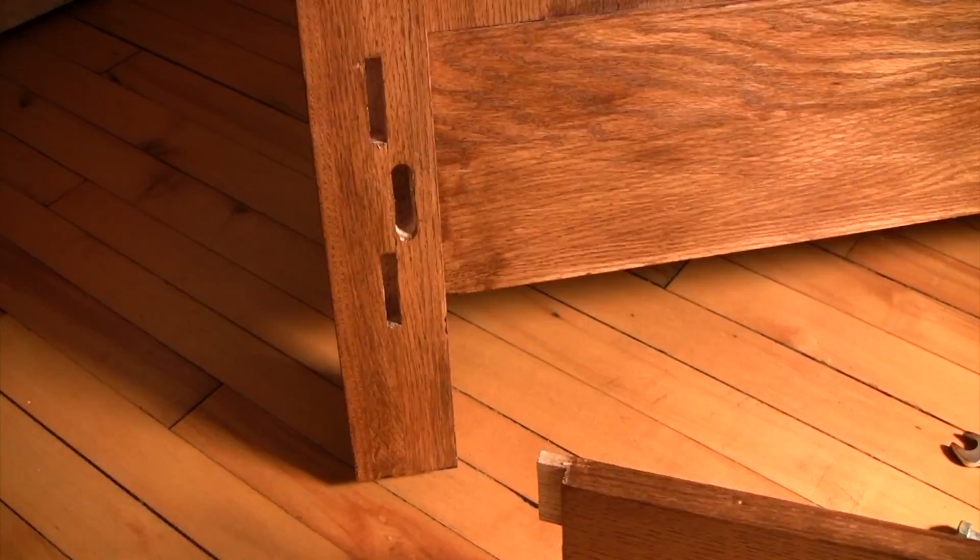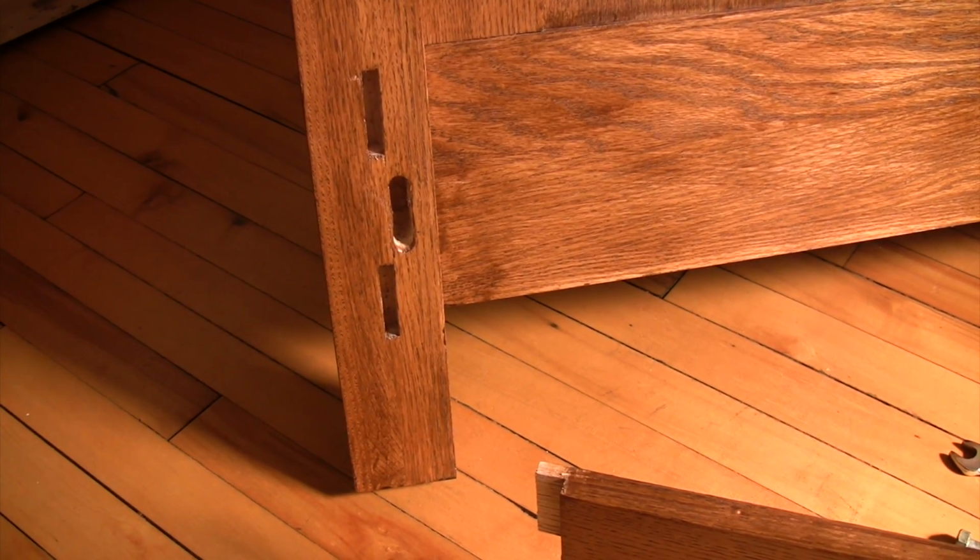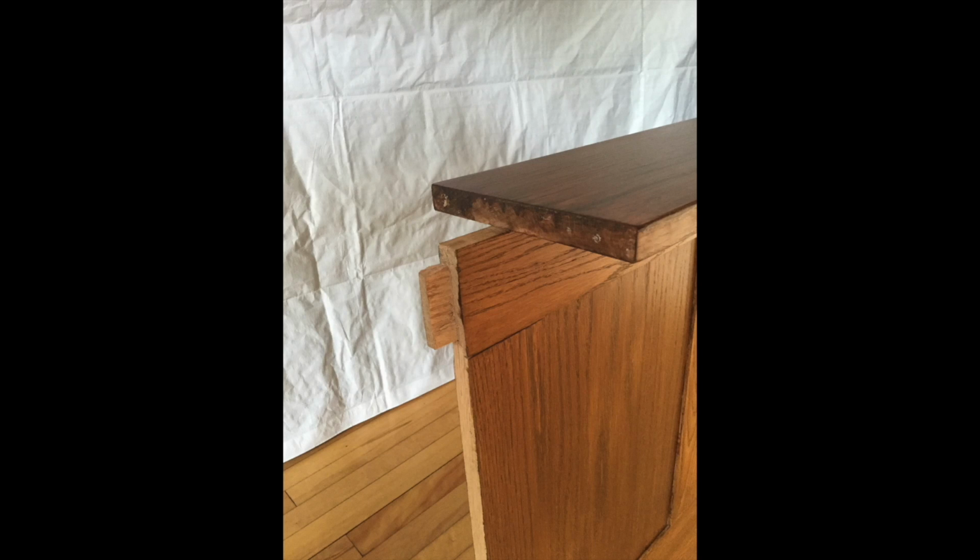Here you can see how the mortises are set up. The two facing the outside are for the sofa frame, and the single one facing the inside is for the eye bolt. The top of the back panel just has one large mortise and tenon joint. The two screw holes that you can barely see on the edge of the top trim board are for pocket screws. I added those to keep the trim board for the back panel aligned with the trim boards for the side panels.